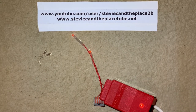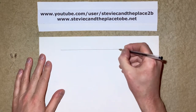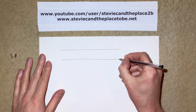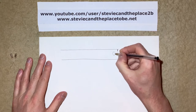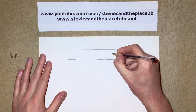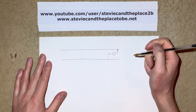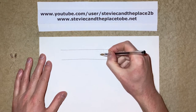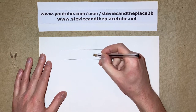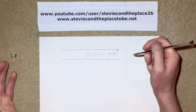I've been playing about with these neons and I thought it'd be cool to make a bulb out of them. What I thought I would do is have two bus bar type lines running along the length of the lamp, and I'd install a neon in here with its resistor across the two bus bars. Then maybe I could do two neons in series, again with the resistor, rinse repeat all the way along.